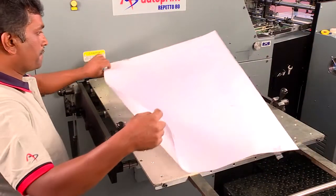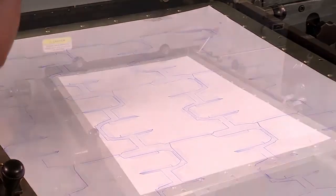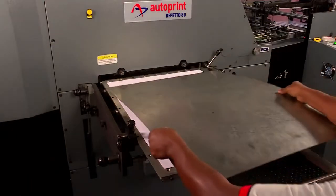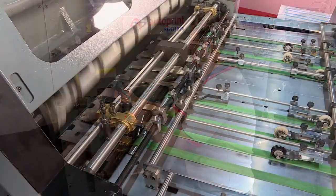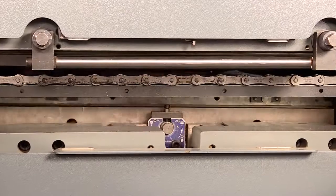This sheet is fixed at the back of the die in the chase bracket. The die and 1mm sheet are reloaded, and one sheet is kept on the apron and a cutting impression is taken at minimum pressure.